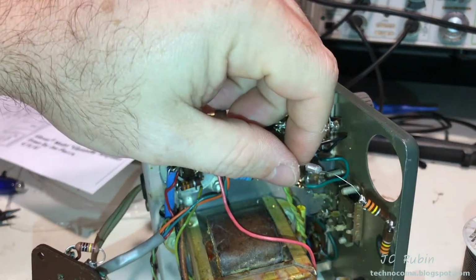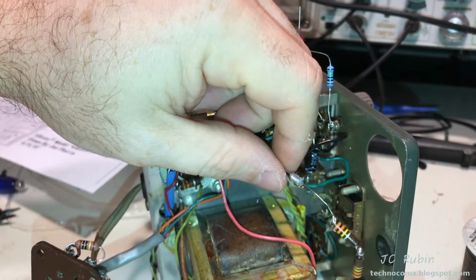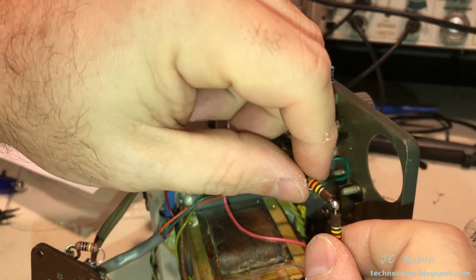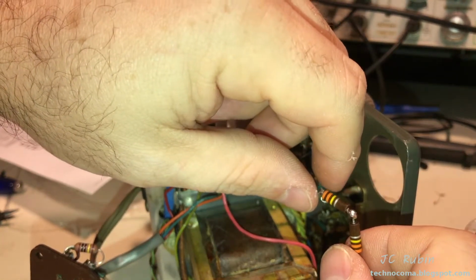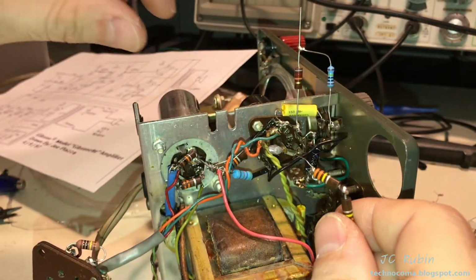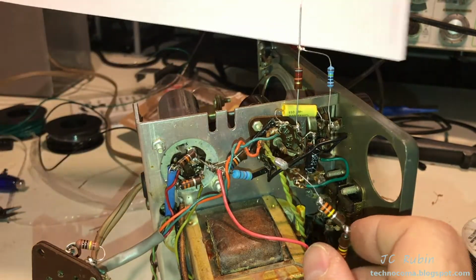I want to talk about what this dangly thing is right here. I just got through the Genrad and got this 500 picofarad capacitor thoroughly tested. But I just want to talk about this before I put some heat shrink over this and it can't be seen. Basically what I did here is I took those old resistors that were used for another application on here, and it comes out to about 700, 800K, and made a center tap. What this is going to emulate, basically for the purpose of this circuit, is the tone knob at 50%, give or take. I mean, it's not going to be perfect, but it's just going to do the job till I get a tone knob in. I'm just going to show that here right now.